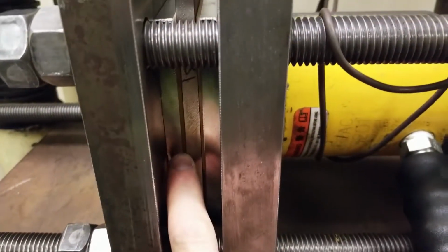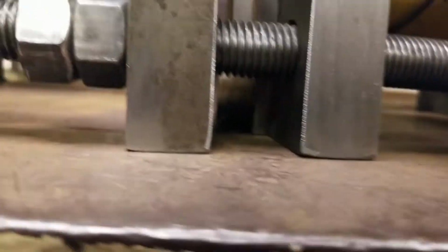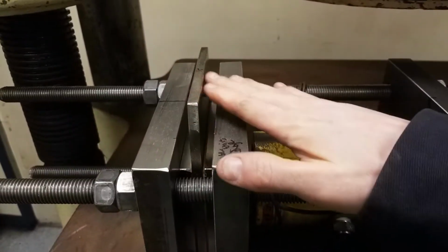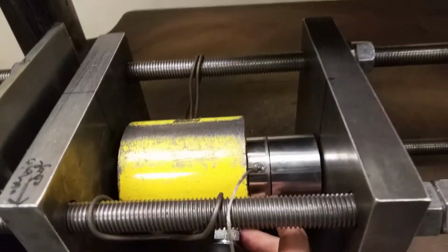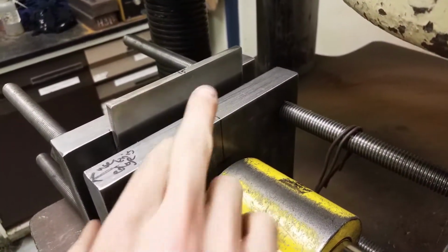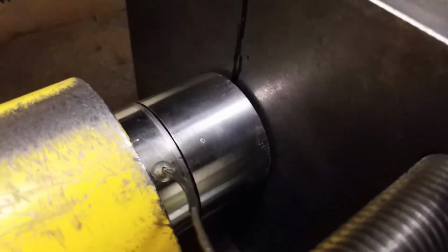You can see the plastic material is right here, and here's the center plate that they're mating against. It's suspended 1 inch up above the surface to get the travel. So when this is lowered, it'll travel 1 inch until it hits the test bed right here. I have centered all of this by marking the center locations vertical and laterally, and then outline them so that I could set it up correctly.